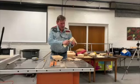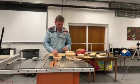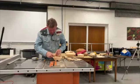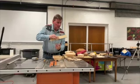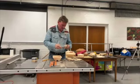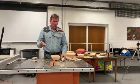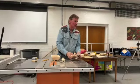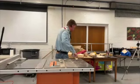For the angle for this slot, this time just take yourself a piece of straight edge, a piece of junk wood, and put it on the top. Take your molding, the side up you want up. Let me do it on this side. This is the angle you want. You're just going to trace that angle. Set your angle just like we did before, except when we cut the bottom, we tilted the blade towards the fence. This time we're going for the top, so we're going to tilt away from the fence. I'll show you the setup on that because you have to use a sacrificial fence.